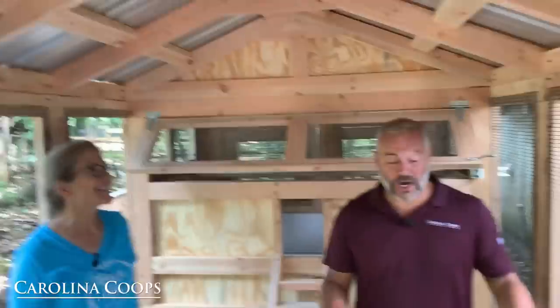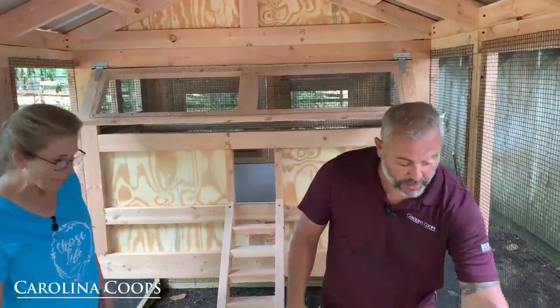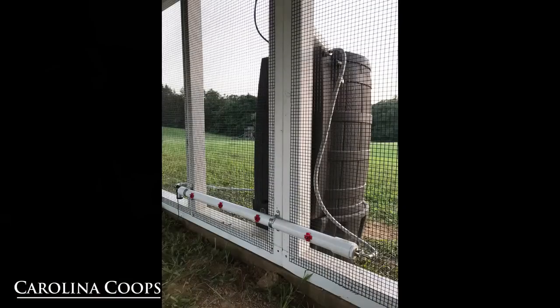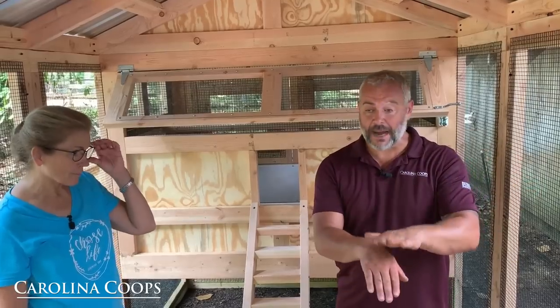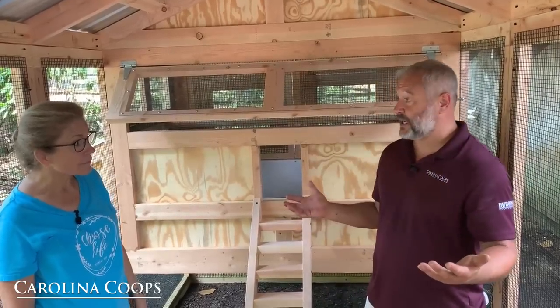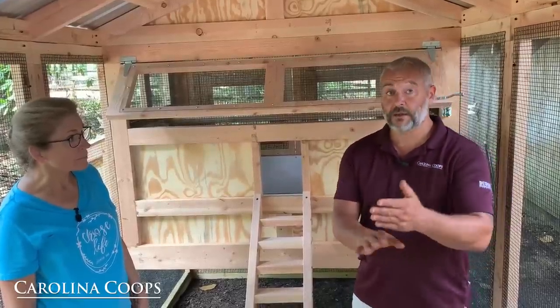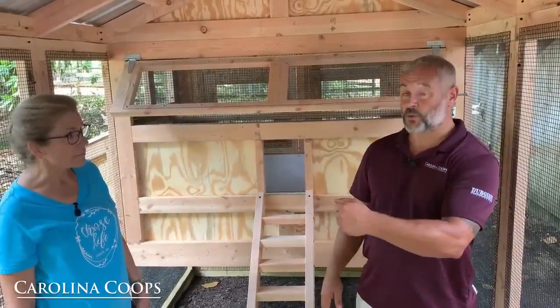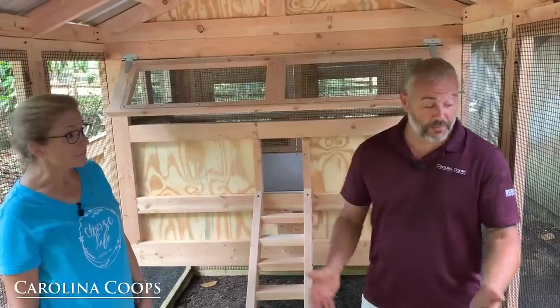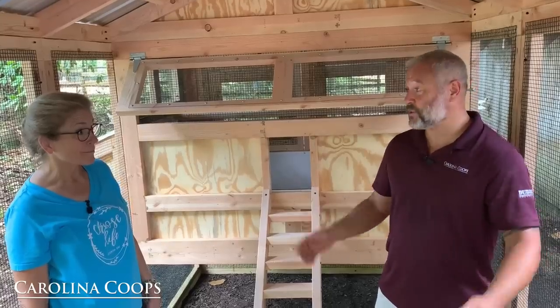Yeah, this is wonderful. Awesome. No bending. Yep. One thing we are going to do is send these guys a water bar to put in, and they have a water source right off to the outside that we are going to tie into a rain barrel that will have a float valve on it. So you don't have to worry about gutters or anything like that, but you can have it top off with the float valve. And obviously you get hurricanes here. The original idea was to have the pump from your well feed the water bar directly with a pressure gauge, which is a common practice, but if you lose power, you're not gonna have pressure for water. So a great idea these guys came up with is let's hook that up to the rain barrel so you have redundancy and protection to make sure you never run out of water.